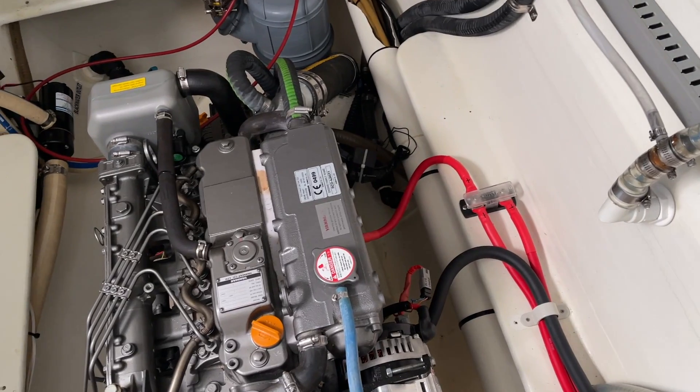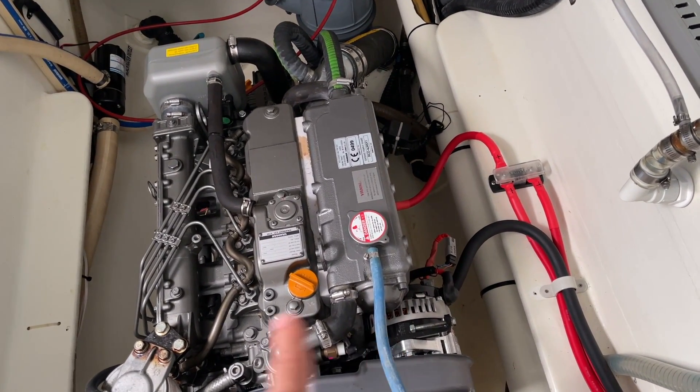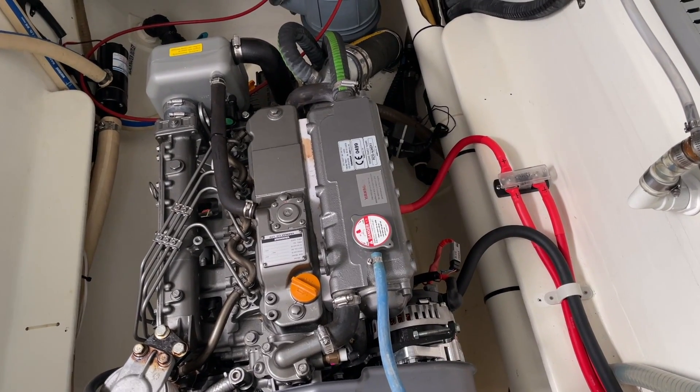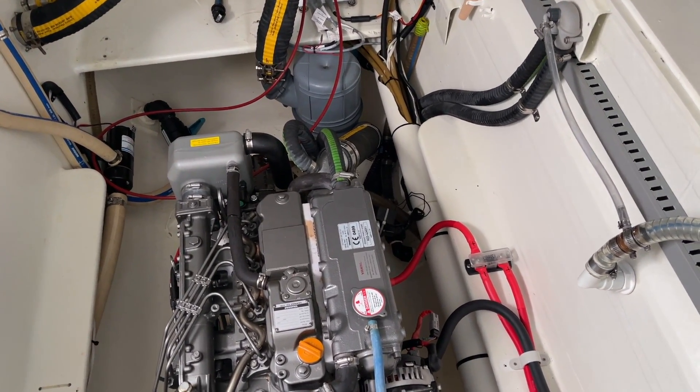There's the power distribution that you can see going forward to it. New alternators either side with just one Scotty — they can do up to 250 amps apiece, and so when he's motoring he can charge at 3000 watts.